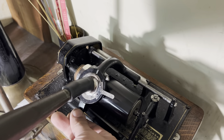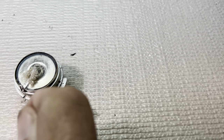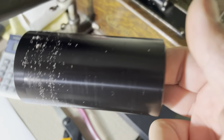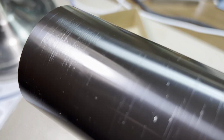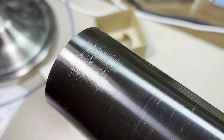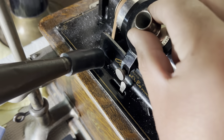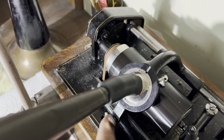We're going to shut off the machine and now remove our recorder. So you have a lot of cutting swarf there on the top. Remove our blank — there's going to be a lot of cutting shavings on there. I'm just going to blow it off and then inspect under the light. There are our modulations. So we're going to put that back into the machine and put our playback reproducer on there and connect our horn. Let's see what we get.